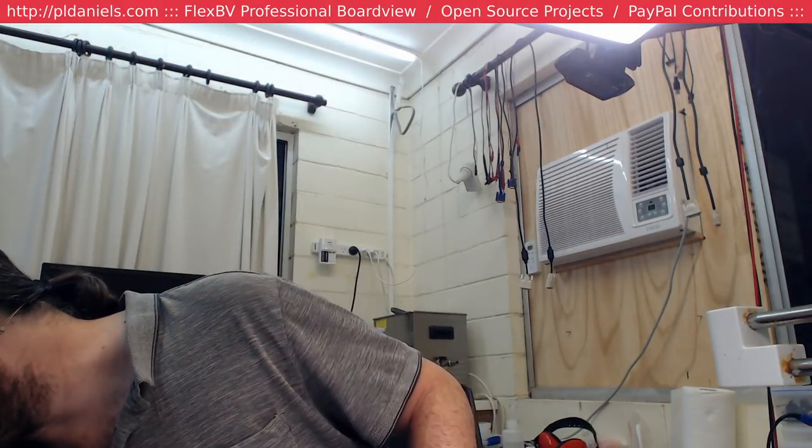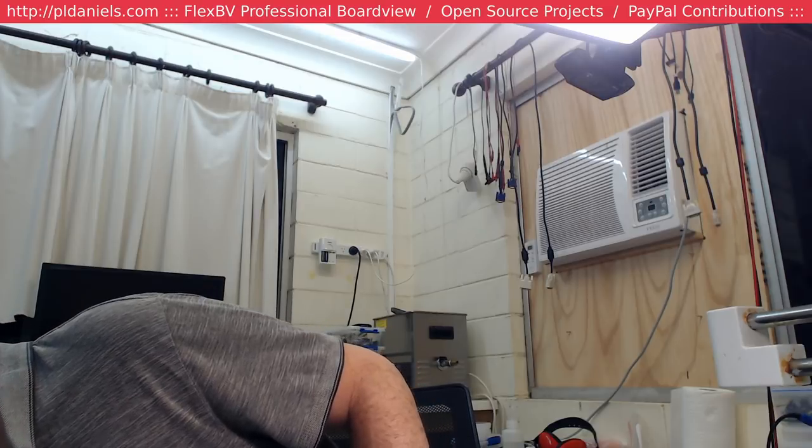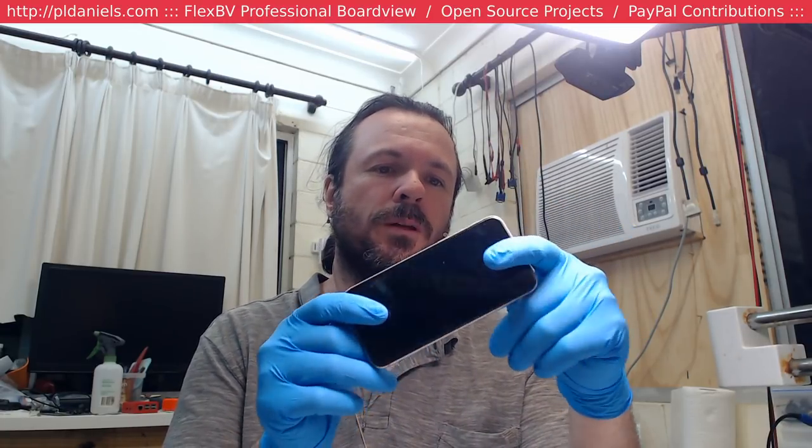Anyway, we've got a job that's come in. It's an iPhone 6S. It was supposedly working, and then it just got hot and died. So here's hoping that the got hot and died bit isn't the Wi-Fi chip. They didn't specify whereabouts it got hot, they just said on the back. So who knows? The reason I don't want it to be the Wi-Fi chip is because this is a 6S, which means I can't replace it, because I do not have a programmer for such things.